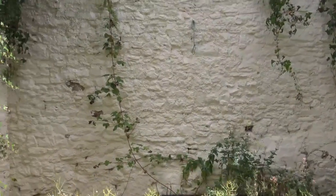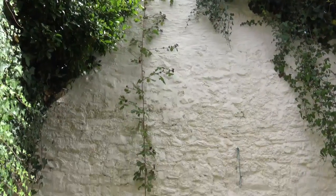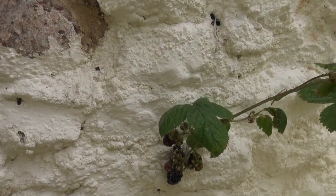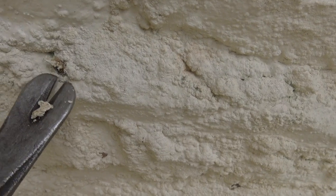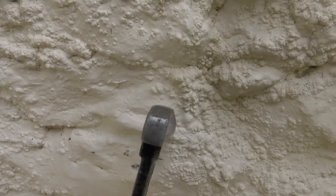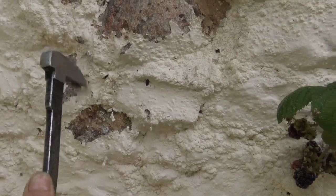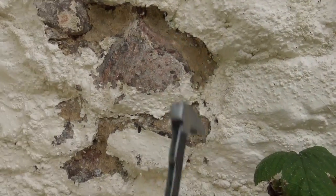This is the big high retaining stone wall — you think it's going to be wet because the ground level is up there somewhere, and this is about 20 foot or so. The problem is using weatherproof paint, silicone paints and things. You can see here this stuff is almost like cauliflower, horrible efflorescence. It's hollow and sounding. This is plastic masonry paint that some idiots put over the top, and it's trapping moisture everywhere into the mortar and into the stone. See how easily it comes off — it's just awful.